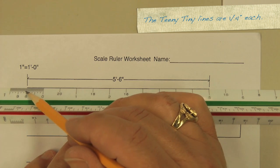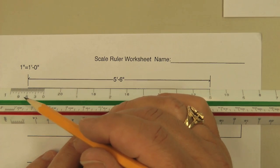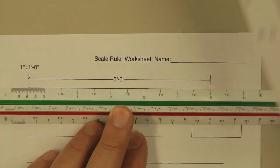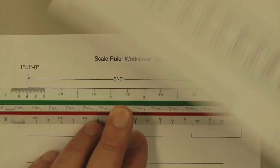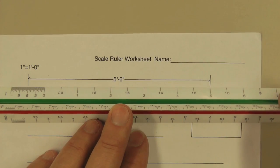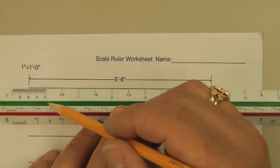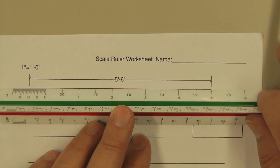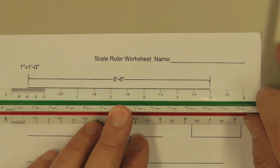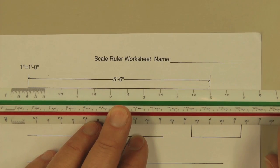You really need to have your real scale rulers by the time you get back. The paper scale ruler doesn't cut it for the class, but for this worksheet it'll work. In this particular example, doing the paper on paper, the accuracy of the paper one — because the lines are as thick as they are — is not as great as we'd like. The accuracy of this plastic one is going to be better, and if we take a really close look at this line and line it up right at the end, we see that according to the plastic ruler, this thing is five feet six and a quarter inches long.